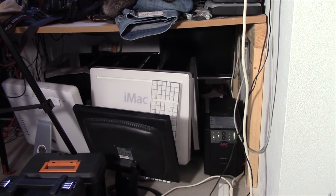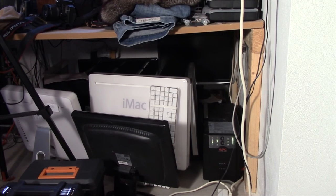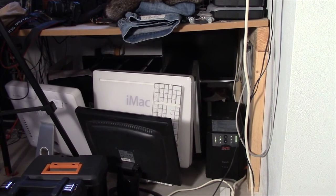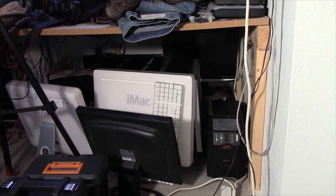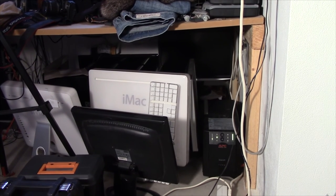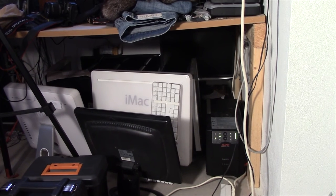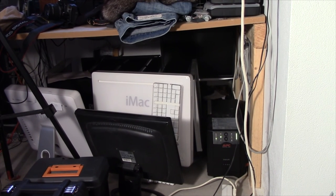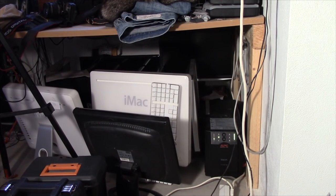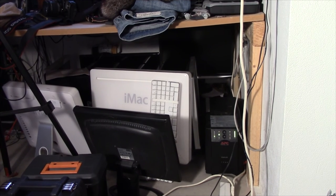I'm happy that I managed to recover pretty much the full capacity of these batteries by just cycling them a couple of times and charging them up to a fairly full stage and giving them that strong shock with the 50 amp power supply. So everything turned out well in the end, I suppose. But yeah, I'm not going to make this mistake again.